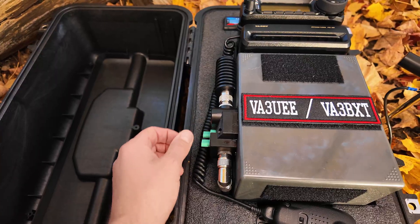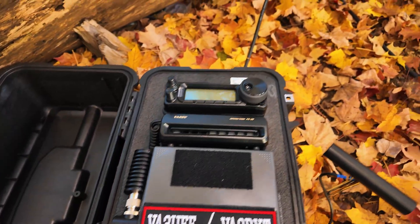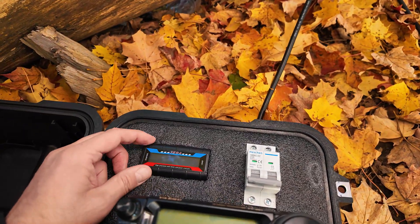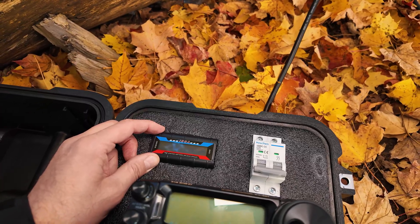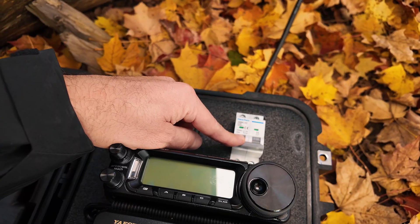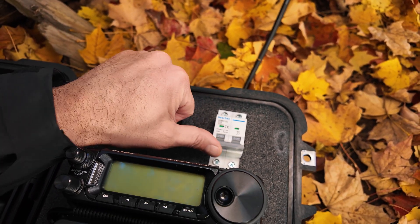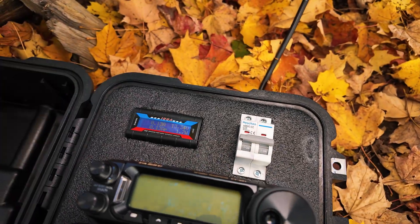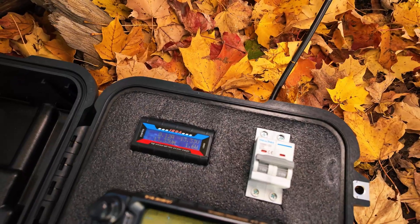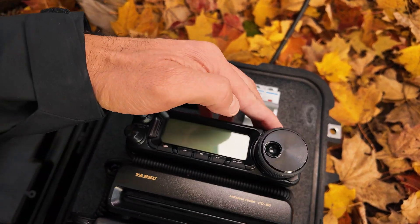The LMR cables are more than enough for the HF frequency band. If I'm going to go live, switch it down and we're good to go. Right on top here, I've installed the load control units and two DC power breakers on each power source. To turn the power unit on — you can see I've got 13.4 volts — and I can go ahead and turn the radio on.